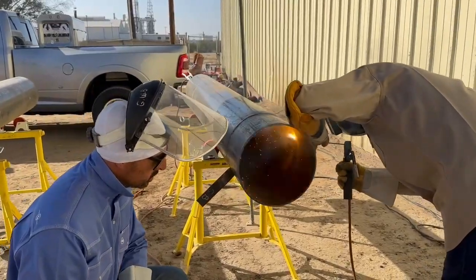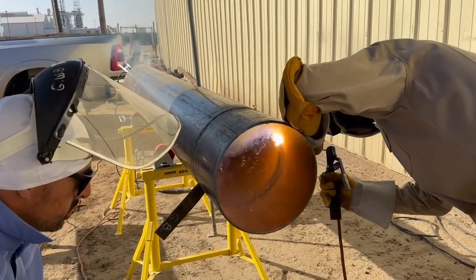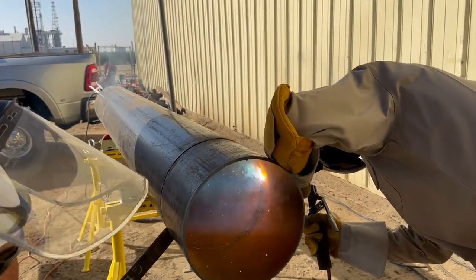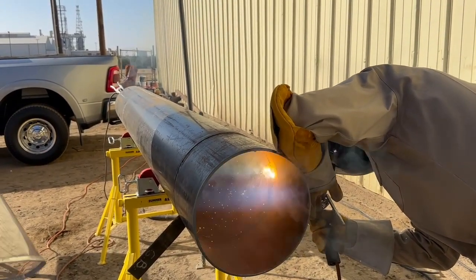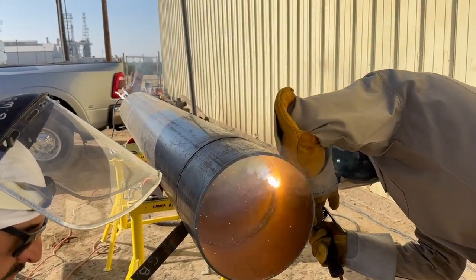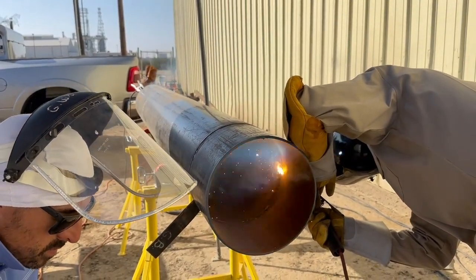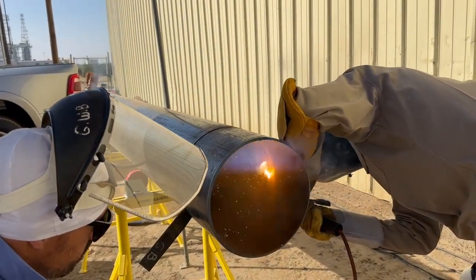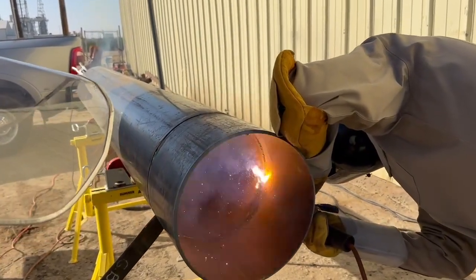You want to have a technique that you use over and over so your subconscious knows what's going on. You can see this is a little wide right here — I'm having to get out of the puddle, break the arc, let it cool just that split second, and go back in. Then I'm wiggling my hand a little bit. That's a technique you can use for a little bit of a wide space. If you wiggle that rod side to side, it turns the rod so it catches one side of the bevel and then the other — it helps bridge that gap.